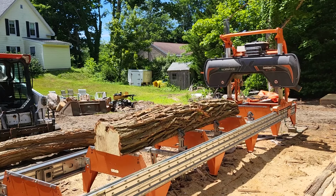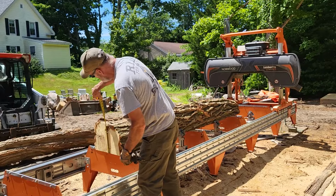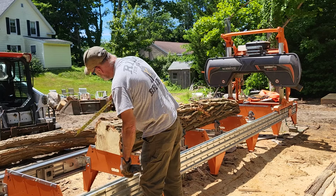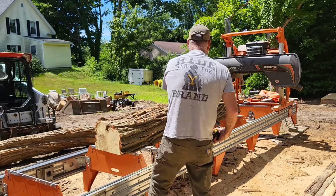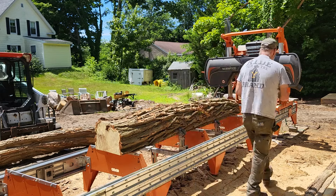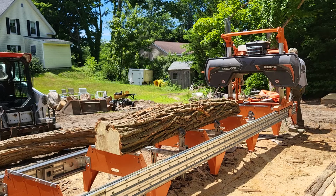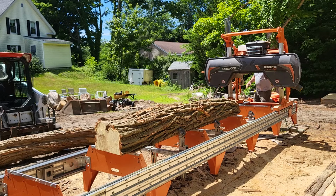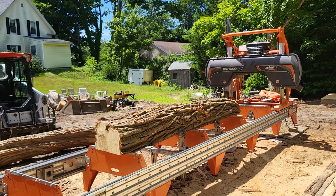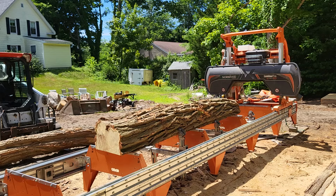All right, so we got it flipped over. What I'm going to do is I'm going to try to come down and take my top cut here at 8 3/8. It's going to be close, but it's going to leave us the most wood. And then drop on scale. I'm going to actually set my 8/4 scale at 8 3/8 because I want my bottom slab to come out 2 inches. So I'm going to drop down to 8 3/8,